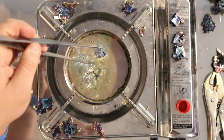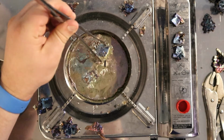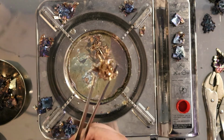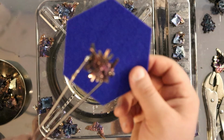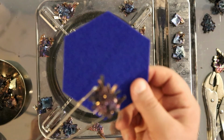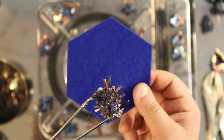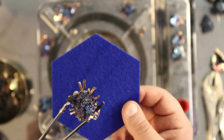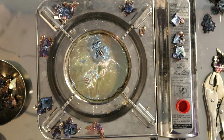And let's see what happened with this one. Well, it's heavier now than it was before. Okay, and again, looks like I had a crystal in there. I was hoping it was gonna melt back a little bit and then regrow from the same orientation, but it looks like the melt maybe wasn't quite hot enough. And so this just sucked a whole bunch of heat out of it, I guess because it was at room temperature, and then formed a bunch of new small crystals. So I'm actually gonna just remelt this one right away to free that up.